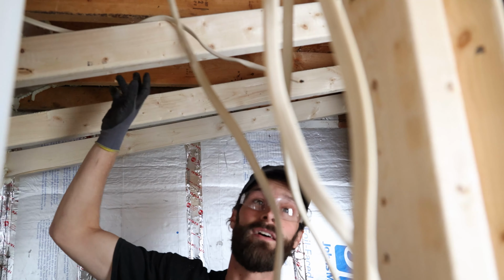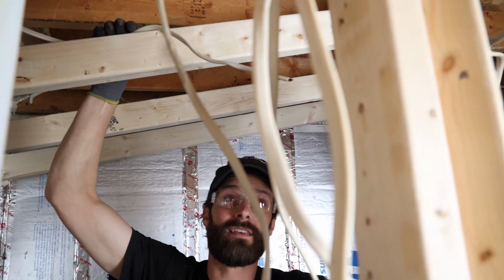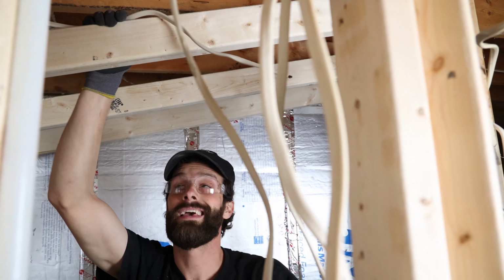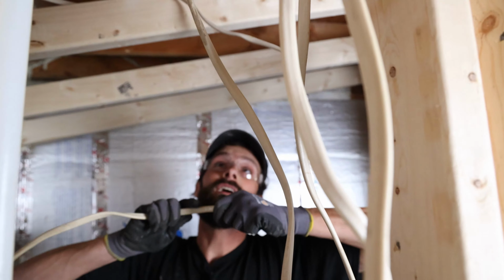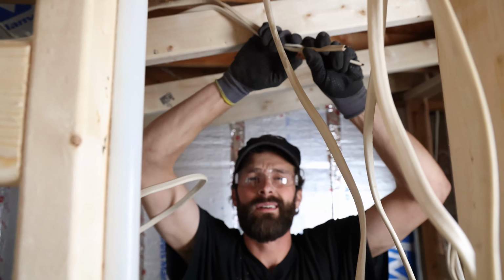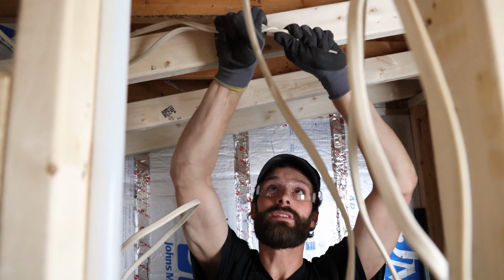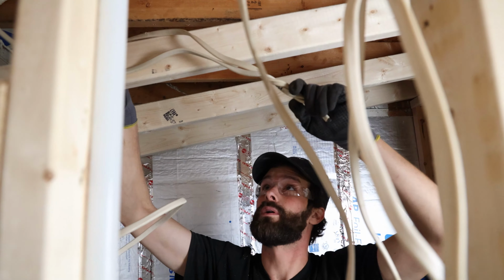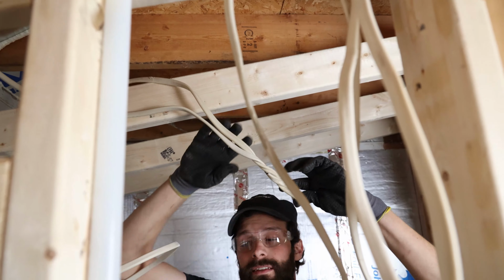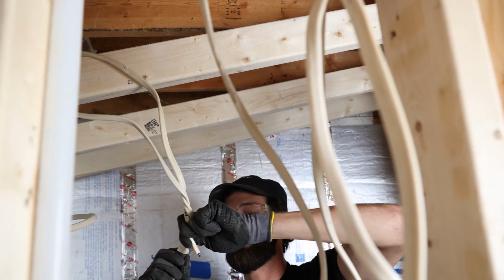See, wherever we cut on the finish out, we can reach up, we can reach across this drop ceiling, we can pull it to where it needs to go. We just wanna make sure we have plenty of slack. All right. Plenty of wire, looks like 2 feet. 2 feet's plenty. See, I'm just gonna literally take these, twist them together. That way if I find one, I find them both. I'm gonna cap the one that could become energized. That's right here. Again, depending on the sequence of events.